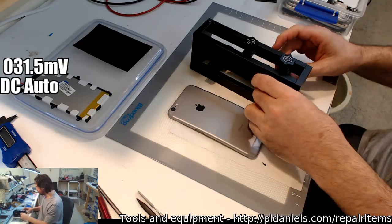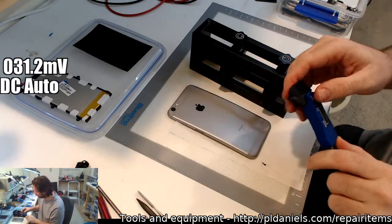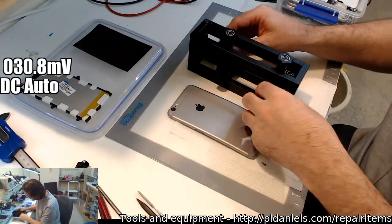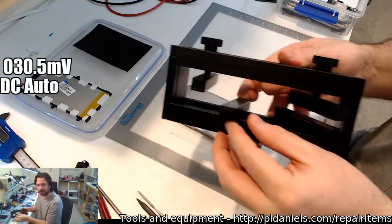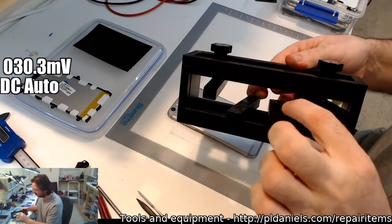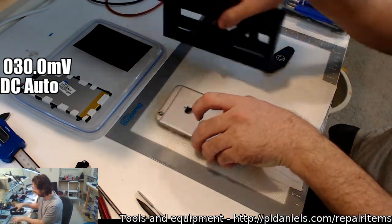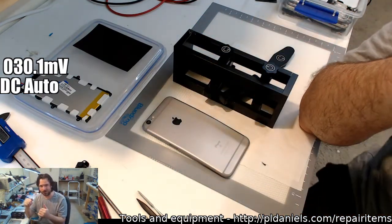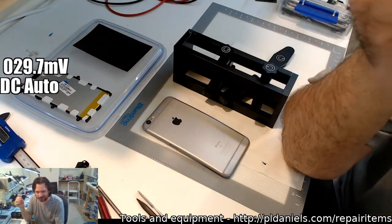So the way you fix this, it's not too hard to fix. If you go out and get some aluminium channel, let's see, what's this width, 15 mil, something around that, and you either cap over, so like you put a bit of U-channeling, man, I'm not good at this yet, over that, and over that, so that you lift up by at least another 3 or 4 mil, so that when you do bring down the top press bars, it will overbend the chassis so that when you release, it'll be straight finally. Put your shim under the... Yeah, exactly, Cormac. Yeah, 5mm ply.